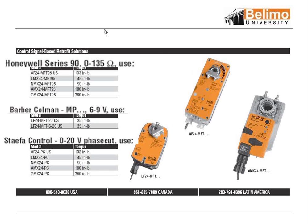And Barber Colman had the old 6 to 9 volt signal for phase cut control. How often do you see those now — is it still common? Well, on Barber Colman specifically, when Belimo entered the valve retrofit market, that was the market targeted. There are Barber Colman motors still out there and still sold new that we refer to as 'beer cans' — they look like a large Fosters beer can. They use that 6 to 9 volt signal, and there are complaints in the field about hydraulic oil leaking. This is a very good solution, and it's been around on valves for at least seven or so years.